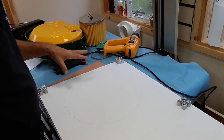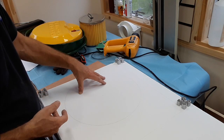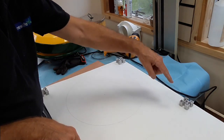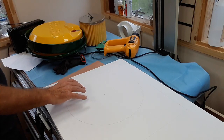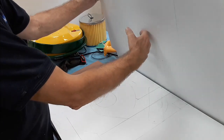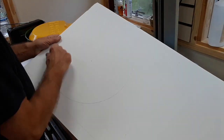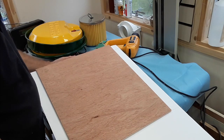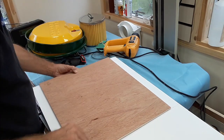The next thing I've got to do is cut a hole in a piece of wood for that to drop into, and that will form the top of the vacuum part of the affair. I've already planned out roughly each level — there'll be a cart with aluminium legs up either corner. That's the top vacuum bit, that's the underneath, then there's the top of the baffle, the bottom of the baffle, and the piece that goes down into the bin at the bottom. All I've got to do now is transfer that circle onto a piece of wood. I've cut six pieces to the same size to fit between the four corner aluminium bits, so I've got fixing points in each corner.